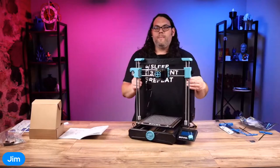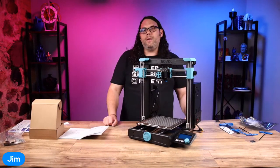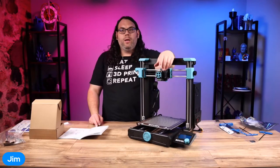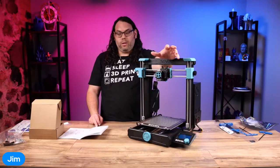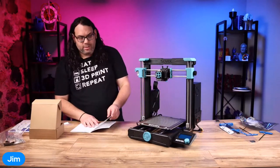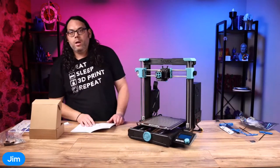Very creative, I'd say. Are there 3D printers that use multiple colors at one time, not in the same filament roll? Absolutely. Not necessarily pushing three colors at the same time so you get a mix. There's two color ones that I know, or some that do a mix if you want. There's several different ways you can get multicolor prints. Depending on what slicer you're using, you can do it by changing layers. You just tell the slicer, stop at this layer, do a filament change. You change your filament when it gets there, then it keeps going in your new color, and you can do different colors at different layers. It's pretty cool too.